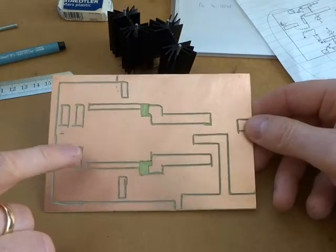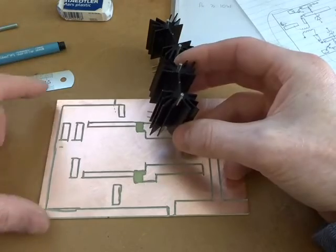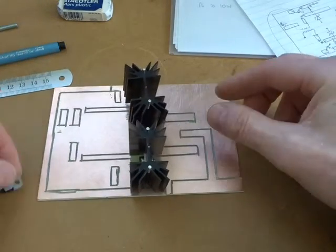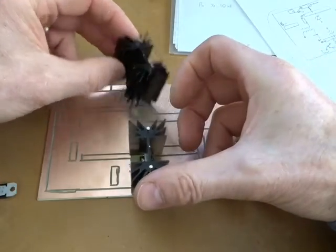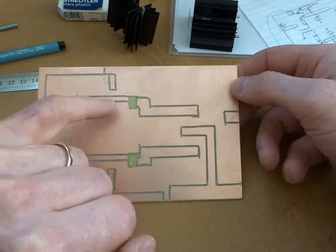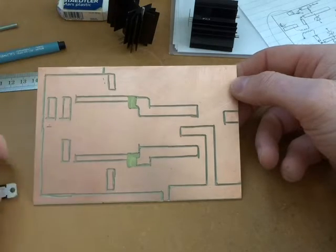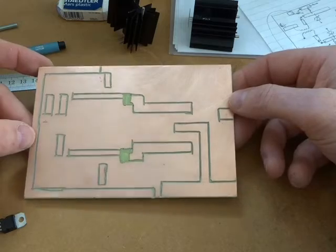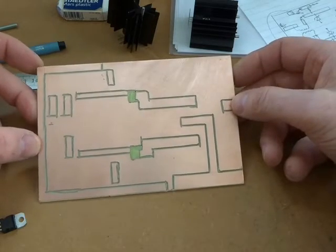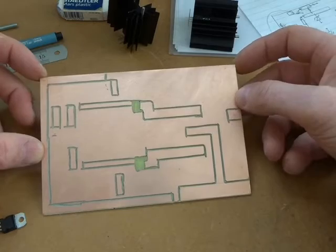So it's pretty well exactly as I described last time. I'm going to try these heat sinks with the IRF510s for the amount of power I'm going to be putting through them — they'll just sit down like that. I've got the two IRF510s there and I'll solder the components on. I think I'll follow the suggestion of not putting the IRF510s in first, but using a couple of 1000 picofarad capacitors in their place, just to get the biasing voltages set up and make sure everything's working tickety-boo before putting those in. A quick easy way of doing it — not overly flash but certainly functional. That'll be enough to prove out the circuit, and then for the final version I'll use the milling machine to make it up.